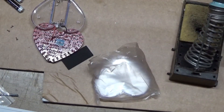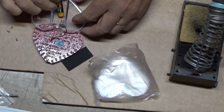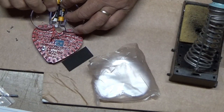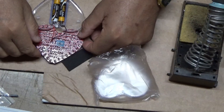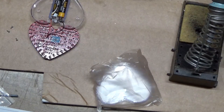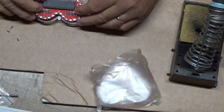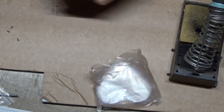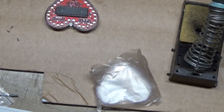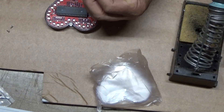I've got all the soldering connections done. I have two AAA batteries to get installed. Before I close it up, I want to do a quick test just to make sure there's power. Now there's a piece of foam that goes in for the batteries, and then the board installs inside the case. The switch comes out the back through the slot in the back. These shorter screws hold the circuit board into the case, so I'll install those.